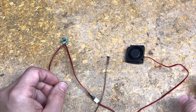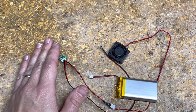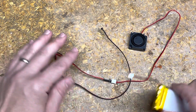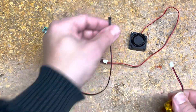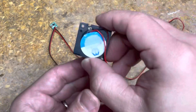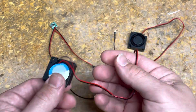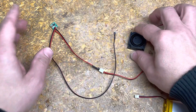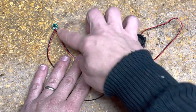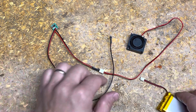Very small footprint. I've seen these kinds of systems as kits on Etsy for like a hundred bucks — you can do it a lot cheaper, especially building from parts. You could also make it with multiple fans. What I'd recommend: don't hardwire or solder directly to the fan — as I found out right before this video, I picked up a fan after powering it on and a wire broke off. Having connectors means you can easily swap in a new fan with no problems.